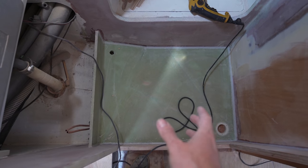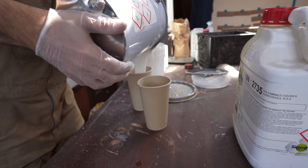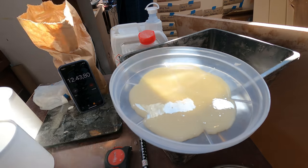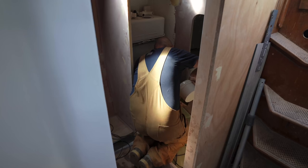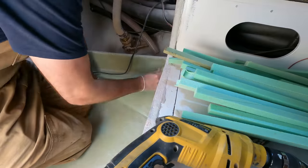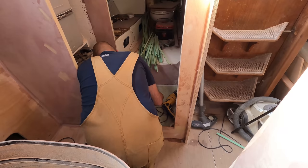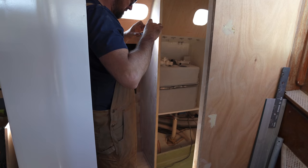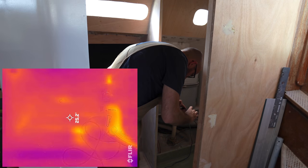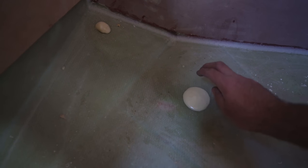Depending on how it flows and expands, we might have to drill a couple more holes. I mixed the resin and the hardener and poured a little bit of the first batch into a plastic lid. As you can see here, it took about 30 minutes for the foam to fully expand. Between the first and the second batch, I realized I didn't have enough foam to fill the entire void, so I shoved a bunch of leftover core material into the void. Then I just kept adding more and more foam while keeping an eye on the temperature — it only ever rose about five degrees Celsius above the surrounding temperature. And then finally foam started coming out the top. This is what the foam looks like next morning — feels pretty solid.